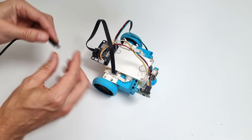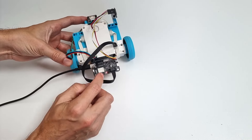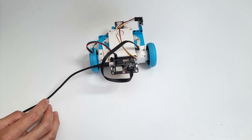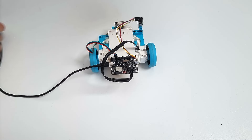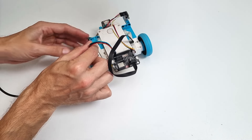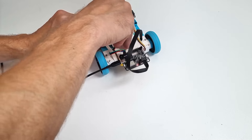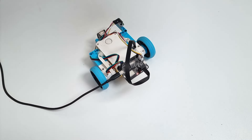To program this board I'm going to connect it with USB to my MacBook. Normally if you connect it via USB the little red LED lights up, meaning the board is powered with 5 volts. Once connected I can use a MicroPython development environment to program it. Normally I use Thonny; for this video I'm going to try Viper IDE. It's something new so I'm not sure if it'll work — let's try it.